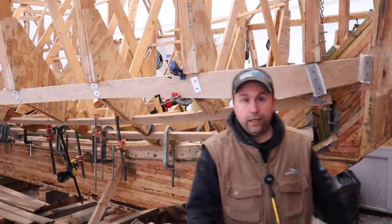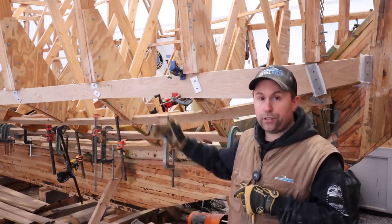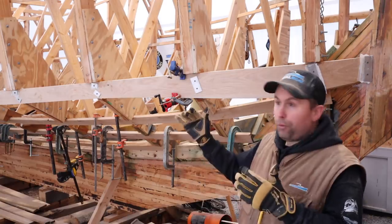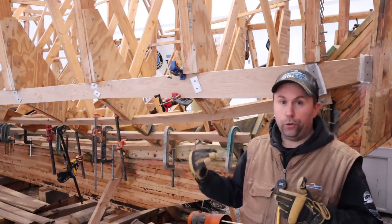So far, so good. We had to use our spiling technique for the aft portion of the chine near the transom, but that was no problem. A little fine tuning and she slipped right in. Now the process will basically repeat for the subsequent layers and on the other side of the boat.